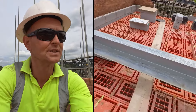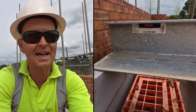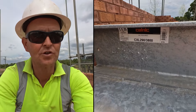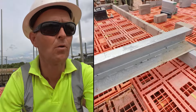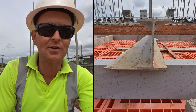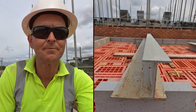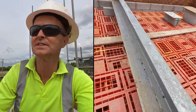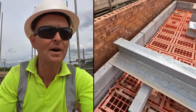I'm going to talk about lintels today. This lintel I've just shown you is a CXL 290/3800, so it's 3.8 meters long — it's a big one. These are classed as a big steel, it's massive. You can see the profile: the flange on the front is where your brickwork sits, and they're upright at the back.